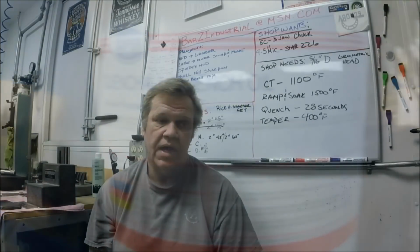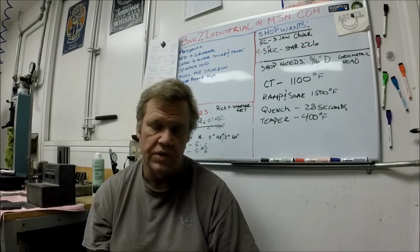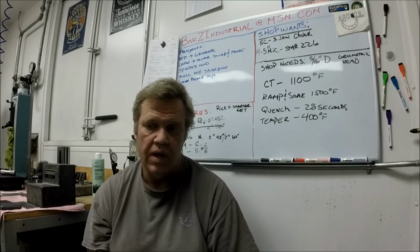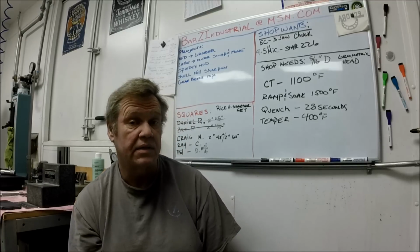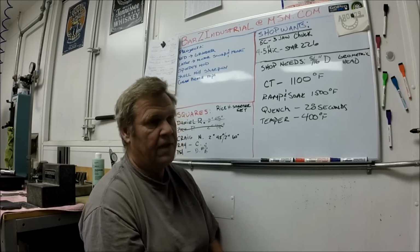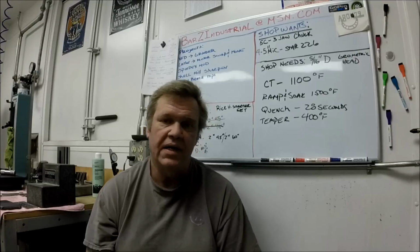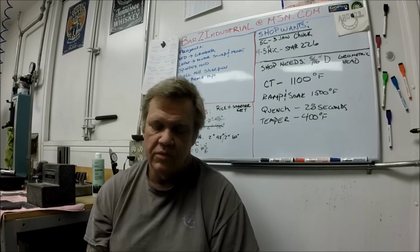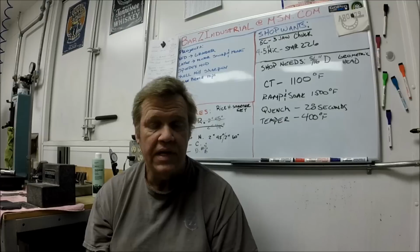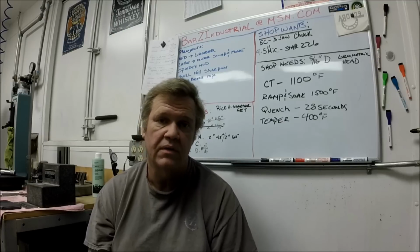And we're back, and that's a special formula. They've got a fast quench and a slow quench, and that's a slow quenching oil. It's a 28-second quench, so I didn't even know anything like that existed. That was recommended to me by Tom Lipton. So let's cut and see. We'll take a look at the squares before hardening, after hardening, and then again after tempering. So let's cut to that.